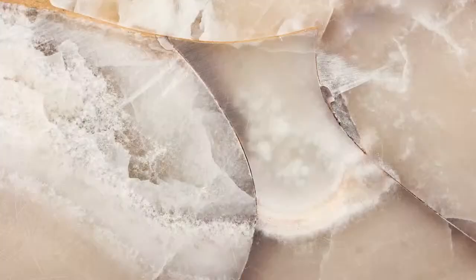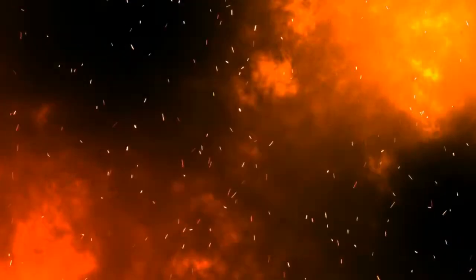In this list, acrylic is mid-range for durability. It's not as tough as stone, but still a good option for those wanting the stone look without the hefty price tag that goes with it. It is non-porous and stain resistant and scratch resistant, but it is not so great for heat, so I wouldn't go putting hot pans directly on the surface. But due to its consistent colour, it is actually quite good for minor scratches and buffing them out. So durability wise, it's pretty good.